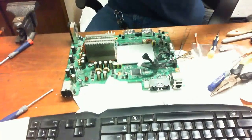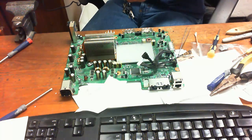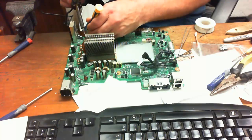Alright. Now, what I'm going to do is hold the component in place with the tweezers and then tap each side of it with the soldering iron with a little bit of solder on the end, just enough to add to the solder that's still on the contacts of the motherboard. So I'm going to hold that component down, I'm going to tap, tap, tap. You don't want to leave it in place for a long period of time. It's not necessary, you'll burn it up. Alright, and then I'll just tap the other side, tap,